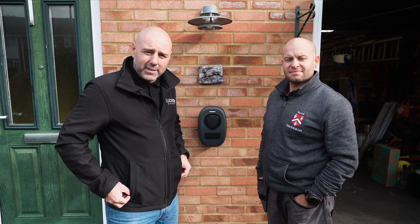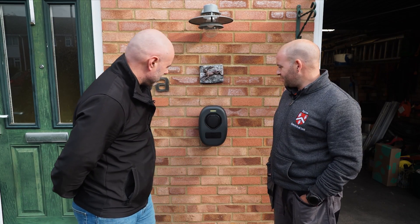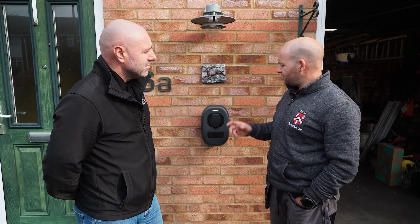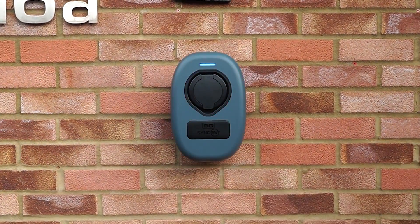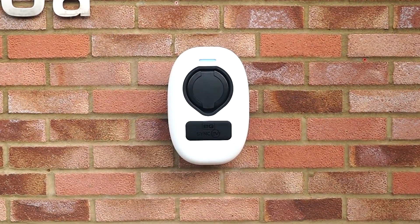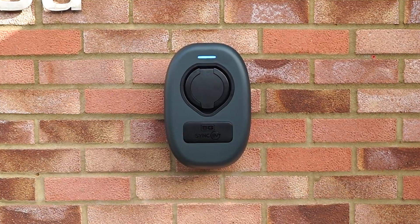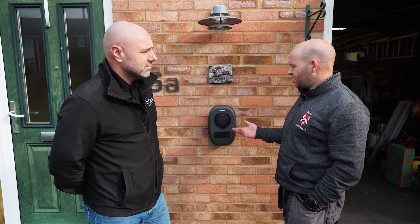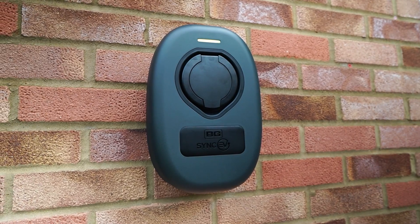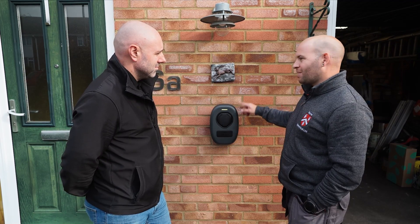The charger's all in and completed. Ricky's done a fantastic job. So Ricky, what was it like to install? Yeah, really good. It's equally as good as the other version, but there are a lot of extra features I really like — like the clamp that goes around the plugs. I like the fascia, easy to fit, easy to remove. One screw underneath and you can change the colours. We had a few issues with the Monta app, but I think that was more my error than anything. I learned that you need to do it directly on the customer's phone rather than my own — it's a much easier, simpler process. There are a few features you need to enable in the Monta app, which then allow you to do your testing with the charging adapter. But otherwise, it's a much neater, smaller, all-round better charger in my opinion. And as installs go, they don't get much easier than going back-to-back with a fuse board.